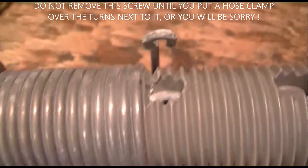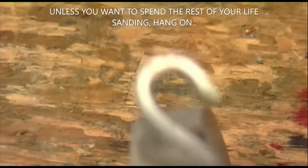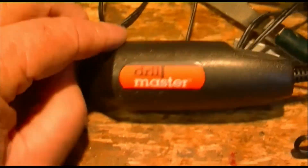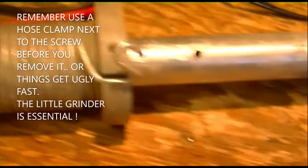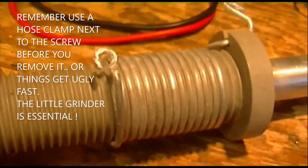So that's no good. I've been working on this corroded piece of wire that connects to the outer sleeve of the trap for about 10 minutes with a piece of 180 grit emery cloth. Well, here we have an utterly cheap, probably $5 Harbor Freight Dremel type tool. And this little abrasive bit was able to get down in this hole and clean that up - otherwise very difficult to do. And we tried it on this thing and brightened those up as well.